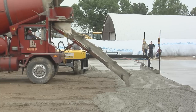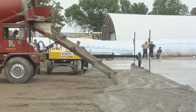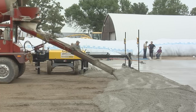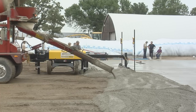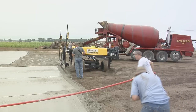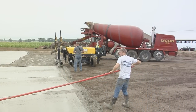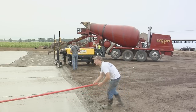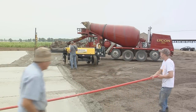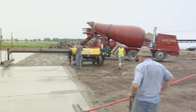Screed Saver Max is a high-production machine. Combine its 16-foot reach with the 12½-foot head and you can screed up to 200 square feet per pass. Depending upon site variables and truck scheduling, you'll be screeding up to 8,000 square feet per hour. For smaller pours, your crew size will be a three-man crew: an operator, one raker for low spots, and a man to float the edges and stick-ups. Reducing your crew size results in less scheduling, fewer people standing around during downtimes, and significantly reduced insurance costs.